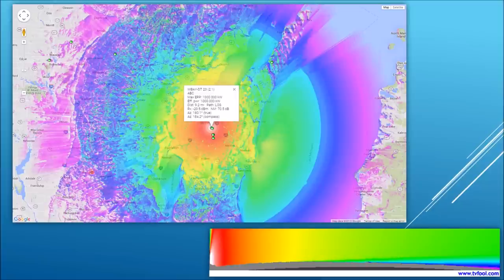Over here, as long as you have a high enough mast on your antenna and a large enough antenna, you should be able to pick up these stations a little bit, but that's going to those extreme measures again. And then obviously you can see in the greens here, we're definitely getting into the areas where it's realistically possible to pick up these stations with rooftop measures. And then the yellows and reds, which are more in the general broadcast area, where you can just kind of set an antenna on your TV and on a good day not really have many issues with it. Maybe a breakup here or two, but for the most part your TV signal will come in very good. And as you can see right in my area around here, I have a lot of signal. So that is really good.